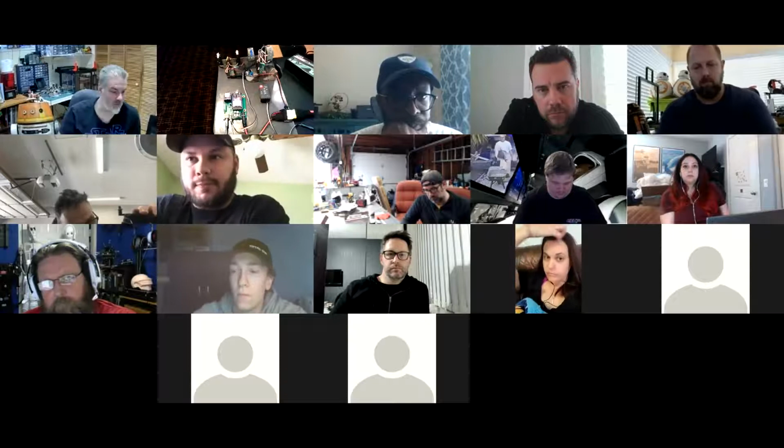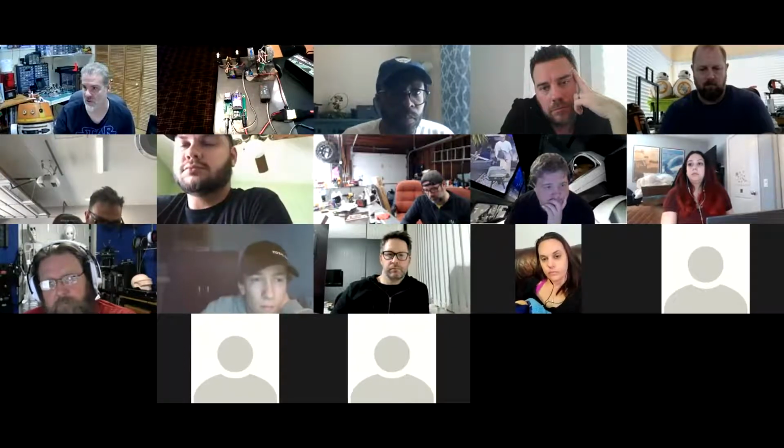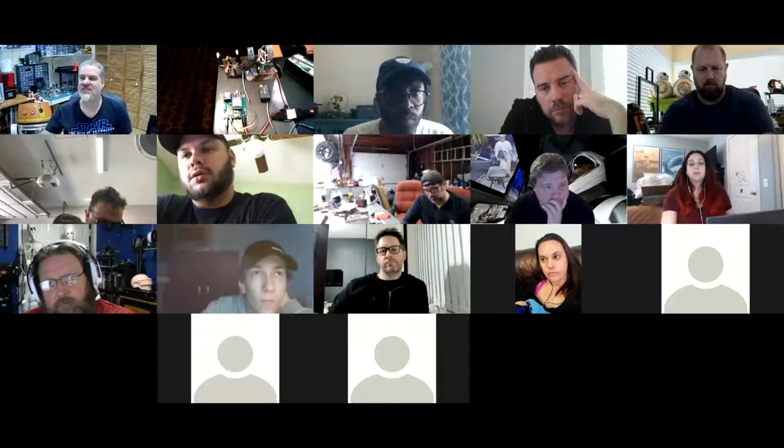Stefan? Yeah, okay. This can be done with the pass-through RC channel, but we have some limitations because of the Maestro. If you trigger a script to run and you're moving the same channel at the same time, the moving of the channel will take over the script. So what I've been able to do is, if you keep your stick centered, it will not send anything to the Maestro. But as soon as you start moving it, it will kill the script. So you have give and take on that.